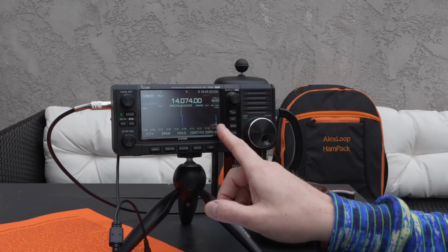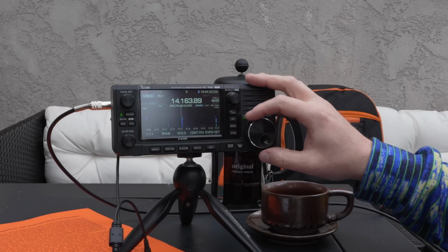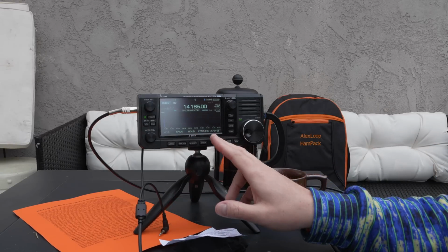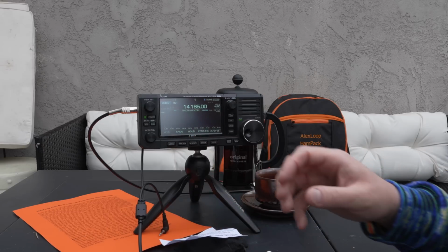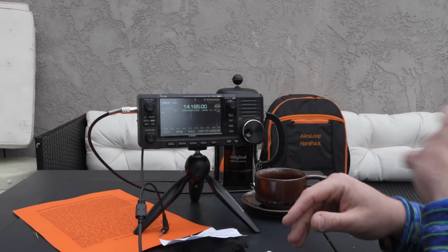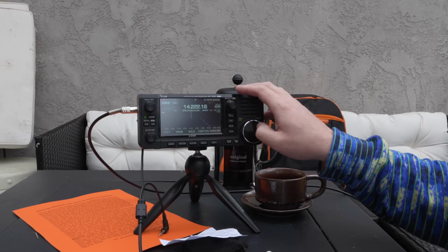This is FT8. Looks like there's another signal here, possibly CW. Let's go over there. Oh, there's the propagation blip. Extra, that's upper sideband. But you can see we've got signals on both sides of the waterfall at about 100K. As you go higher in frequency, the Q, that narrow bit of opening that you had on 40 meters, starts to open up and get wider. So we've got a bit more bandwidth on the higher frequencies, all the way up to 10 meters with this. Speaking of 10 meters, the time is right. Let's see if we can hear somebody out on 10.